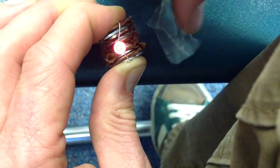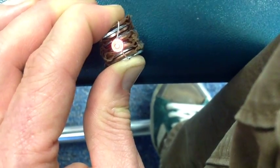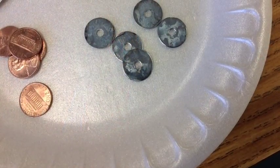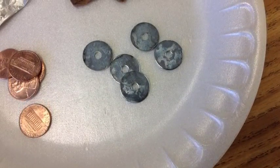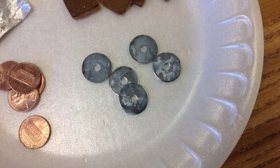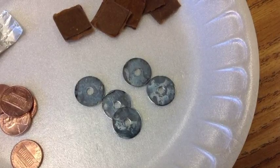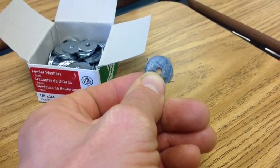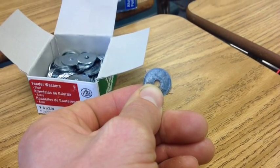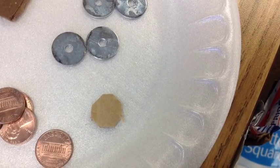This worked well, but look at what happens when we push on the sides. We are going to be wrapping these in tape. What's going on here is the cardboard gets squished and actually transmits some electricity. Because the cardboard was sticking out too much, it didn't allow the battery to work properly. So I took it apart and I am going to recut some cardboard squares so that they are smaller — just about the size of a penny and a washer, which are about the same size.